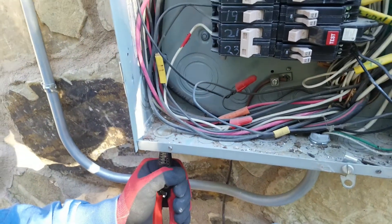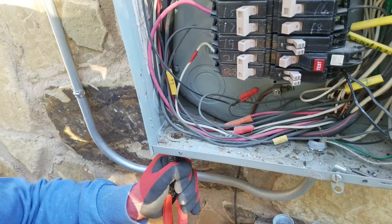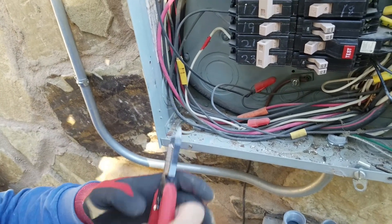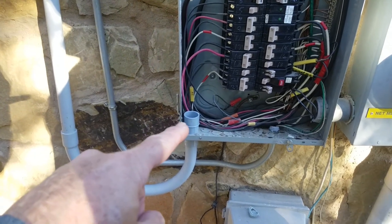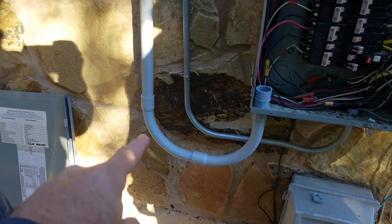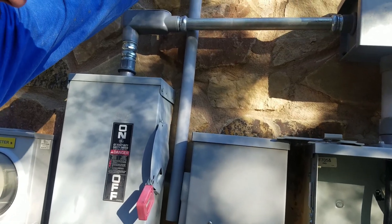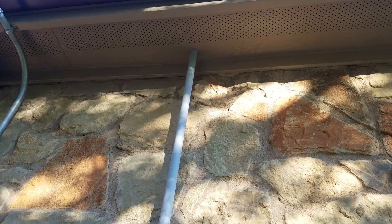Flip off the main. We're going to come out the bottom on this one. We've got one-inch conduit for the 8/3 Romex. We couldn't find a lock so we used a male connector, came down here with it, 90 degrees — we cut an inch off of the 90-degree — and then it's coming up behind all of that, going up in here. We're going to level it off and drill a one-and-an-eighth inch hole.